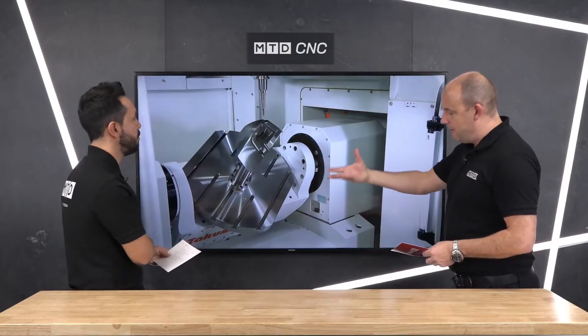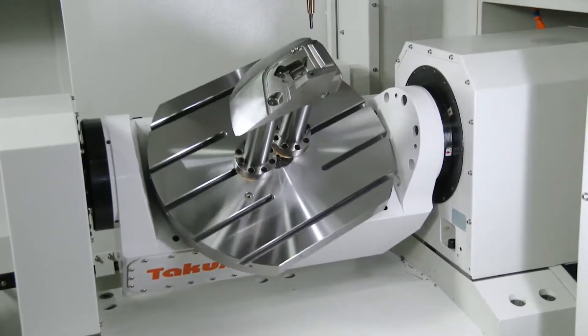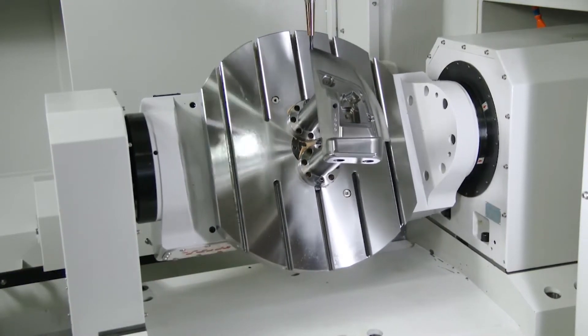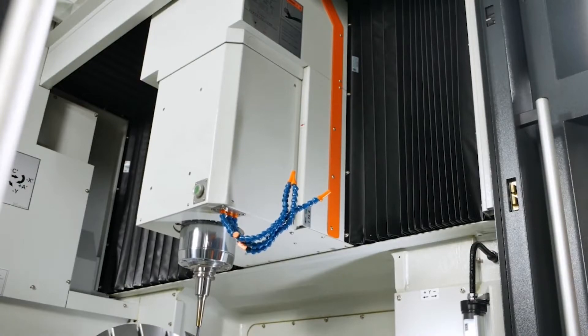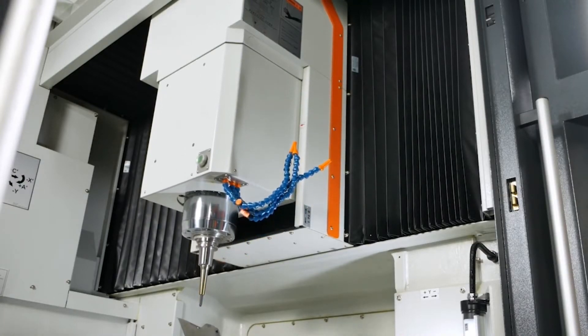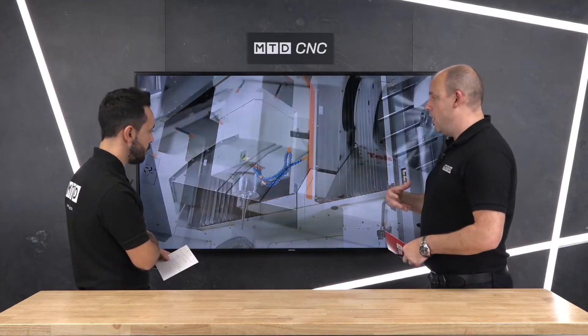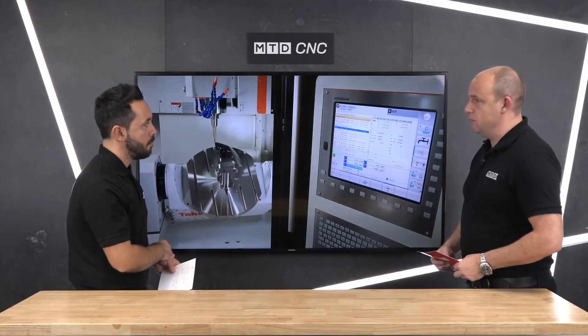The biggest difference here is the five-axis simultaneous motion. All the other features — the dual column design and related benefits — are incorporated into this machine as well. What's quite interesting when you get into five-axis simultaneous is that there are many potential collisions to worry about. The way the kinematics are on this machine, synchronized with the control, means there are built-in safeguards for collision avoidance — perhaps not to the level of a CAM system, but enough that you don't have to worry as much about programming. A crash on a machine like this can of course be expensive.